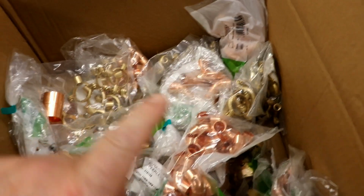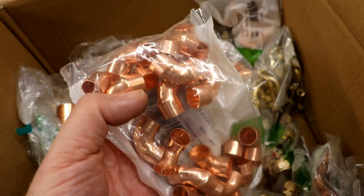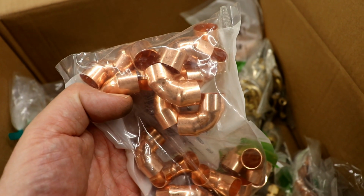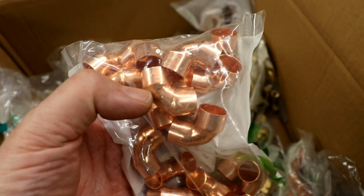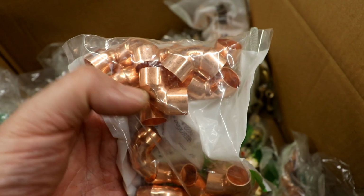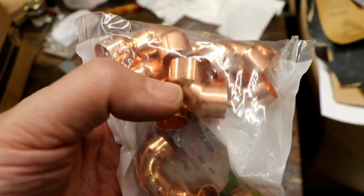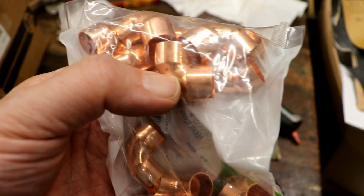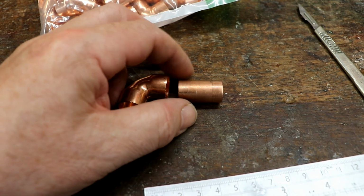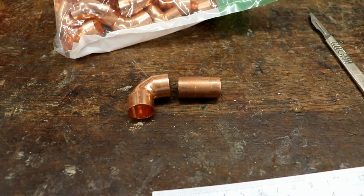Most of these are for the next lot of NEPNet Throbble kits, but I took the precaution of ordering plenty of these elbows, 15mm elbows, because I have learnt through experience, never assume that they're going to be the same dimensions. You don't know what you're going to get. Obviously they have to conform to British standards overall, but they do vary quite a lot within those parameters. I'm so pleased to remember that word. So I can now take that into consideration and finally calculate the length of copper. I think that pipe pushes into there 11mm. I marked it with a scalpel. That's good. Right, calculate pipes.